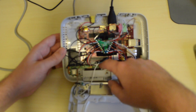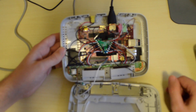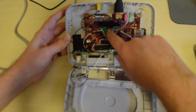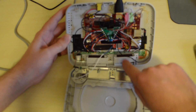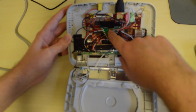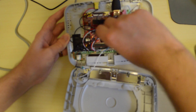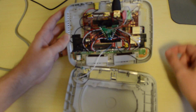As you can see, I've basically just cut the entire front section of the PS1 PCB off. So I have these original controller ports and memory card slots. And then I bought a little USB PS1 controller adapter off of eBay. And then I just desoldered the controller ports that came on that, and then just jumped the wires from the original controller ports onto this little USB one.